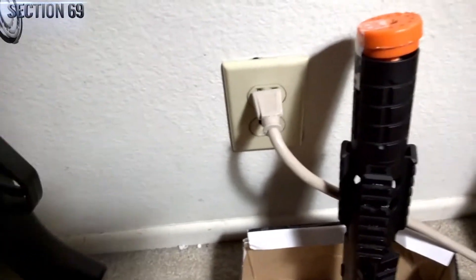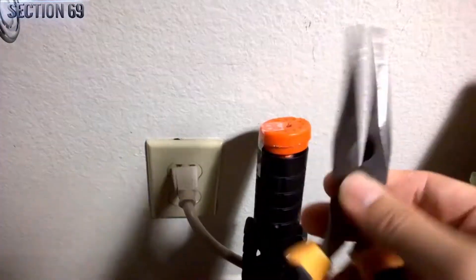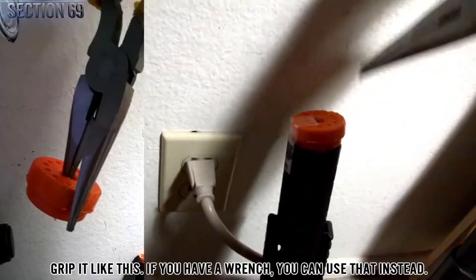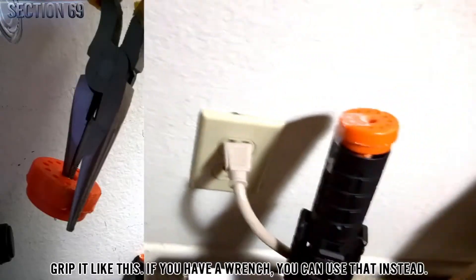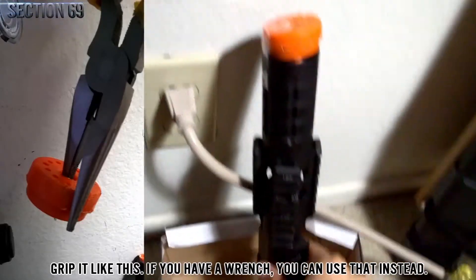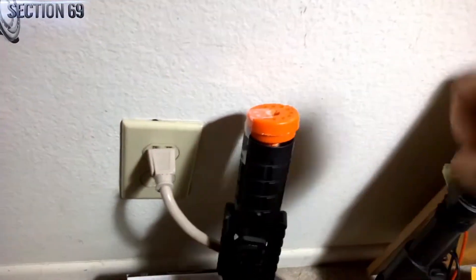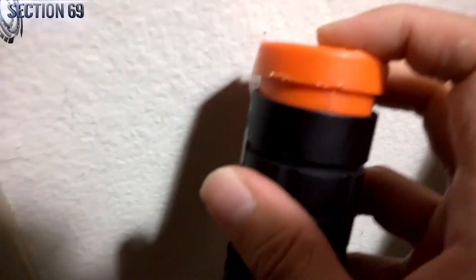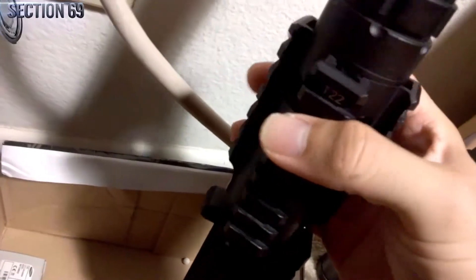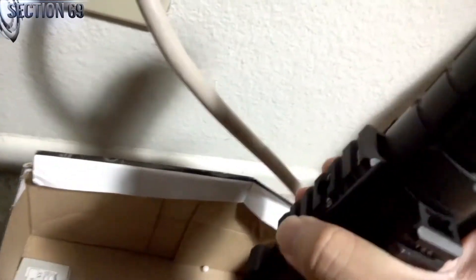So again, you're going to take your needle nose pliers — mine are wrecked from this project, but they're just a cheap dollar pair. You're going to turn in the counterclockwise direction. It does take some force and some strong hands. You want a strong grip on the upper receiver while turning your pliers counterclockwise. You're going to get it to a point where you have about that much of it poking out, and at this point the rails are going to be pretty much free-floating.